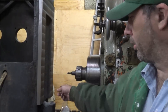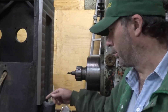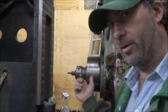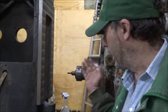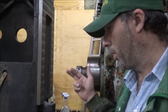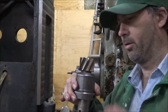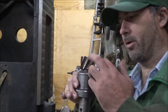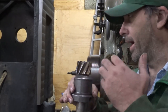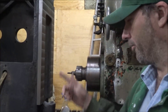I'm getting an 8 thou feeler gauge in all the way over here, a foot from this side. The other way is not as bad, so it could have something to do with this point of bar. But also from what I've measured on this cutter, it's at least 1 thou bigger diameter here than it is here.